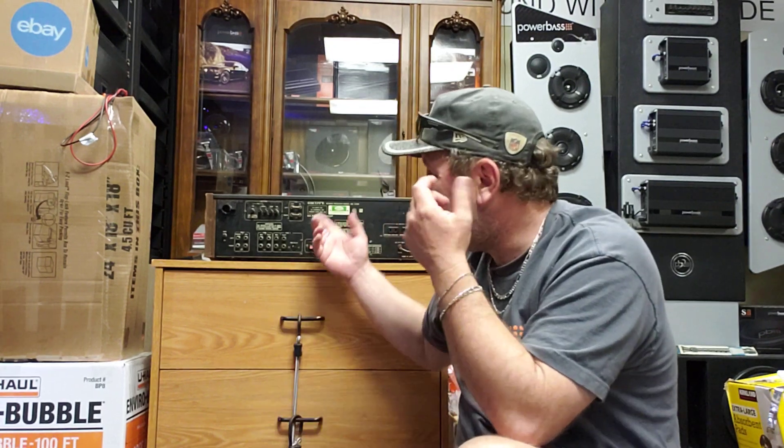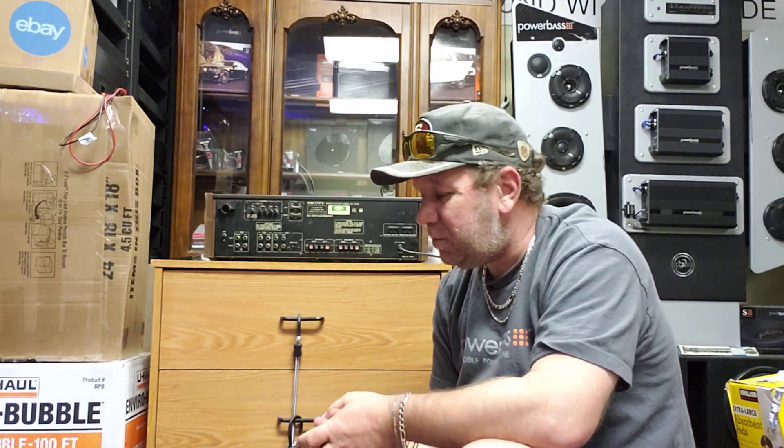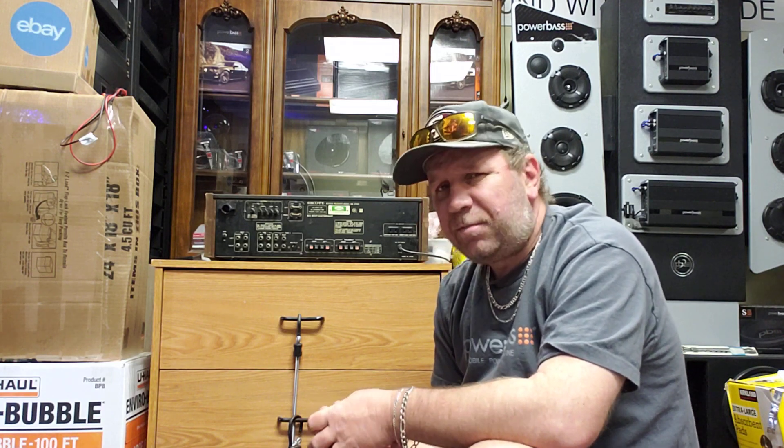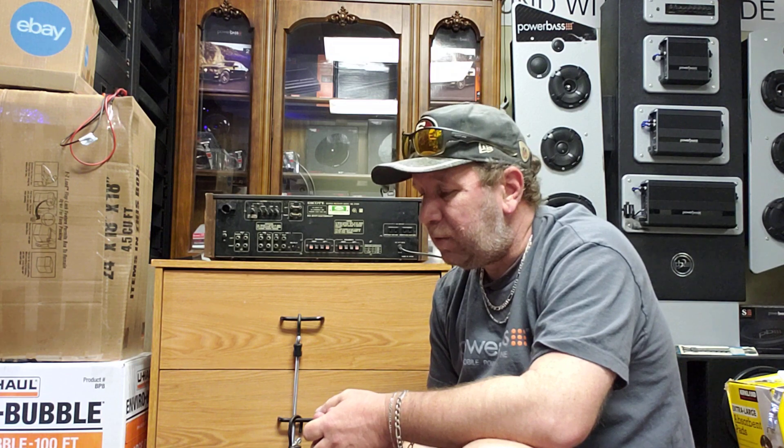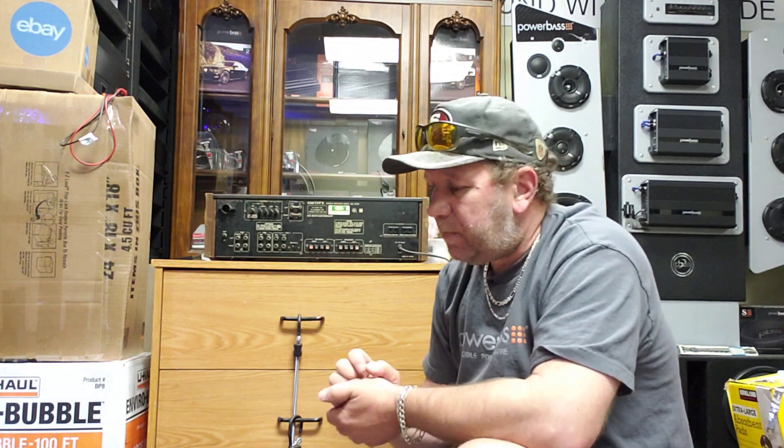So what do I recommend? If you have small speakers, a small room, and don't play loud, you might get away with a receiver at 50, 60, 75, or 100 watts. If you play a bit louder, have bigger speakers and a bigger room, an integrated amp around 100 to 150 watts and up will get you started. But if you want dynamics, headroom, loudness, power, and control, go with a preamp and power amp combo — that's the best way to achieve it.